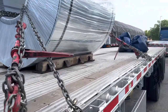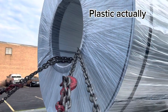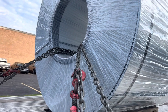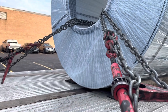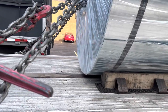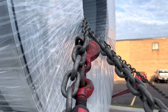We got it uncovered. Now normally — and this coil is very expensive, it's stainless steel — they actually put a rubber insert in it because some guys just won't use edge protectors. But if you get the rubber insert, you don't need the edge protector. A lot of guys will build a bulkhead in front — that's fine, whatever your company requires. Normally though, your first chain you'd want to pull it dead even with the coil if it's a non-finished coil.